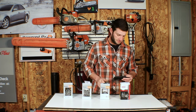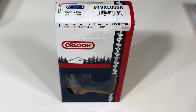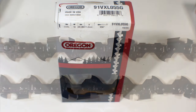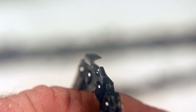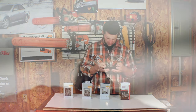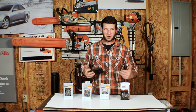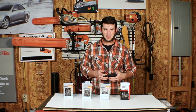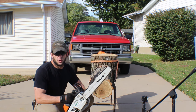Maybe I'll buy a few more. The Oregon 91BXL — the top plate is longer by one-third than the standard 91 cutter. Improved out-of-box grind, superior corrosion resistance, basic cutter hardness consistency, aggressive cutting edge with a forgiving sharpening profile and good stay-sharp. So I'm gonna slap these on the saw, cut some wood, see how they do. Test platform for this is my Stihl 201T CM.